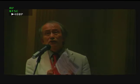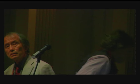Could you show me the details of communication between heterogeneous cores? Probably. So the communication between heterogeneous cores is done through semaphores. We have a set of semaphores that we use to communicate back and forth, and we also use the L3 memory, shared memory, to communicate between the cores. So all memory on the device is actually accessible to different cores. For example, the embedded EVE engine doesn't have a data cache, so you could use the DMA to move the data to the internal memory of the EVE. But internal communication between the cores is done through semaphores and spin locks. Okay, much appreciated.